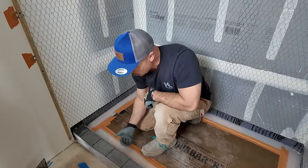What we do is we take a 2x4, a nice redwood, find the cleanest one you can get, no knots if possible. I know there's other parts of the country where you can't even get redwood, but here we have a lot of redwood in our Home Depots. So we'll buy a 2x4 and then rip them into 1/4 inch strips on the table saw and get them real nice and smooth. But that's what we're using here. You can use other materials. Doug fir and pine seem to warp a little bit. I say Doug fir is probably better.